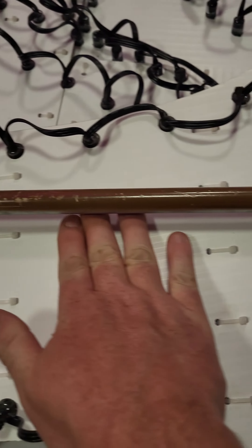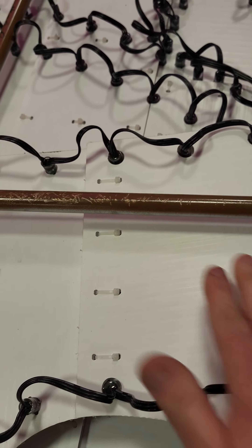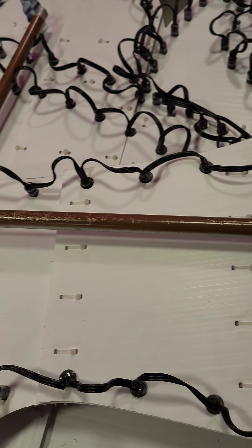With the set screw, it locks in pretty tight. I also 3D print these standoffs. What these do is allow the EMT hangers to be spaced up a little bit, which then clears the Coro, but also gives me a little space where the Coro is double-thick.